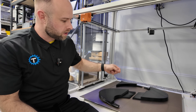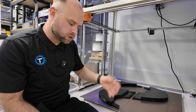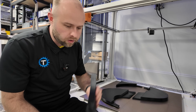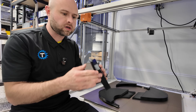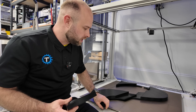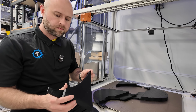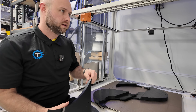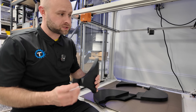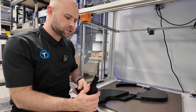So I need to put some glue or something like that on the bed for better adhesion, because this area up front where I've done most of my prints — I guess I'm touching it or other prints going on there or whatever — it's causing some lifting consistently. I only burned about a kilo and a half of filament on it. I kind of already wrote off the losses on this because I wasn't sure it was going to work. But the Giga has been performing beautifully since we changed out the printhead and did a remeshing.